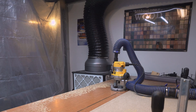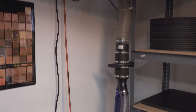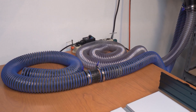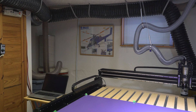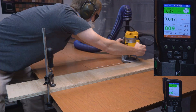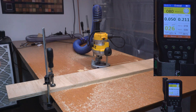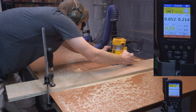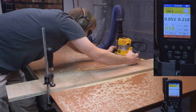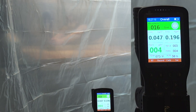Here's a setup with my Model B with 20 by 30-inch filters and a 12-inch inline fan. As a diffuser, I am running a massive carbon filter. For this project, I did run dust collection into the other room. These flexible ducts aren't the most efficient way to transport air around the shop, but with my 650 CFM dust collector, they work pretty good. I have some drop-down plastic walls in here. The air outlet is beyond the walls of the plastic room, so there is always positive pressure on the outside and negative pressure on the inside. This causes the clean, filtered air to be constantly pulled through the cracks in the plastic sheets so that dust cannot escape. With about 900 CFM of filtration, the dust levels never get that high in the room, and on the outside, the air stays virtually dust-free.